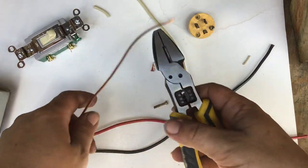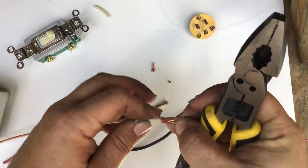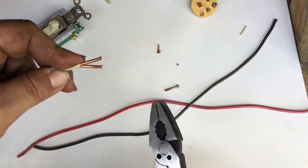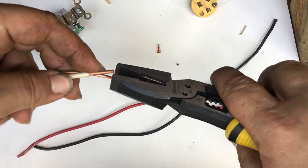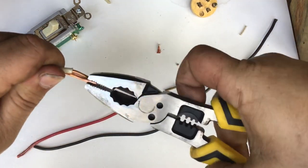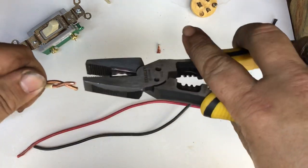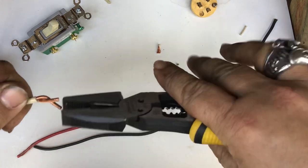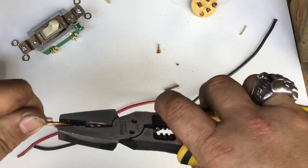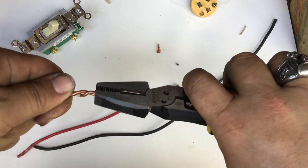Sometimes you'll have a wire nut — you're working on an electrical outlet, hooking your wires up, and you have two wires side by side. This is really hard copper wire. What you do with the linesman is put them together side by side, put pressure on them, and then twist them. The reason you'd be twisting these is because you're getting ready to put them inside a wire nut, or maybe you're wiring up a breaker box, so you can easily twist them into place and thread that wire nut in because it's really thick wire.